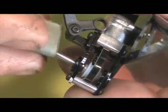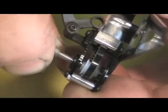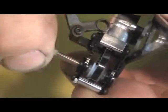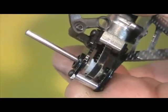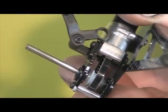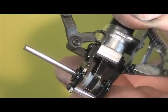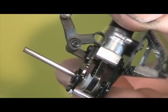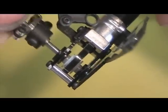The other thing you can do to make a smoother tail is take some 600 or finer paper and just stroke the shaft axially, rotating it, to get rid of some of the grind lay on the shaft so you get a nice polish on there. That will definitely improve the slide. Make sure you clean it off well so you don't have any grit residue that would cause you to chew up your pitch slider.